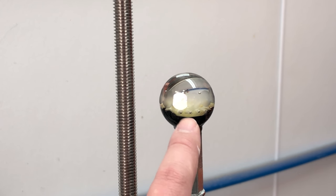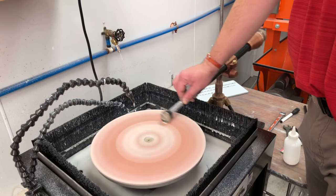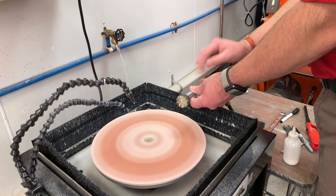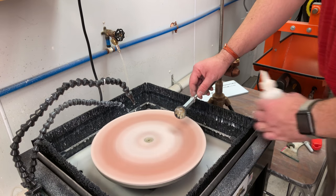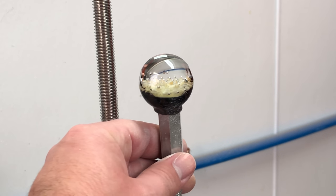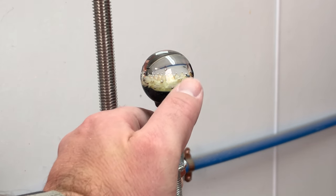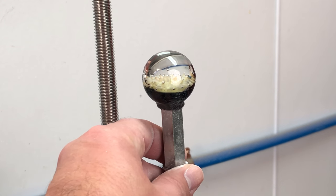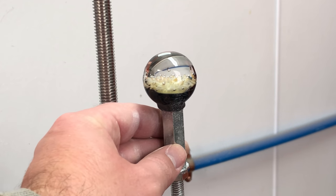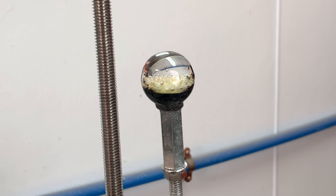So I'm going to follow the same routine, change my angle selector every time for my different angles all the way around, and polish the entire first tier of facets. You can see now that these are all nicely polished and you'll see the reflection moving along some of those facets. It's always a good idea as you're polishing to go through with a flashlight and check that you're getting out all the little scratches. If you change the face angle on the facet arm, you cannot get back to this same facet angle to repolish — so you really do want to double check all of these facets before you move on to the next tier.